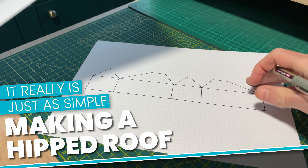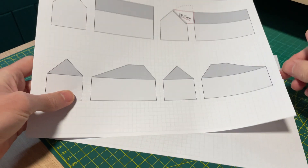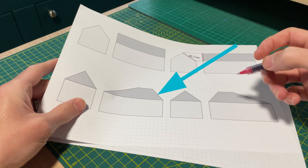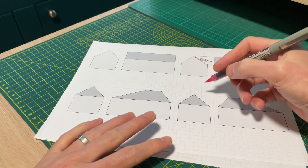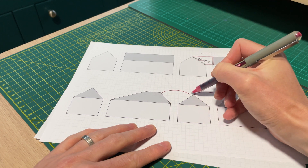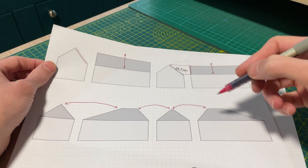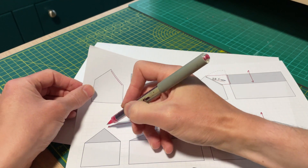Here are the elevation plans of a building with an unusual hipped roof. I chose this to show that the technique works for any angle of roof. This building has the same end profile as our gable roofed one, but it has a gently pitched hip at one end and a much more steeply pitched hip at the other. The technique is just the same — only this time we have several points that need to all meet up: these two need to meet, these two need to meet, and these two need to meet.